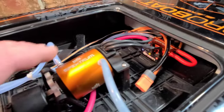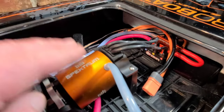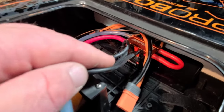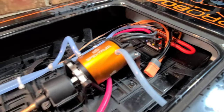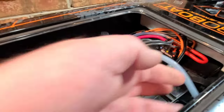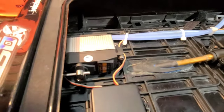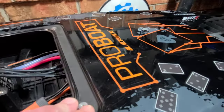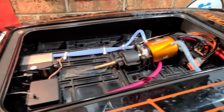This boat's got a 4685 1350KV brushless motor, 8S capable - that thing's got some power. 160 Firma, 8S capable, telemetry capable. Batteries are in the sponsons to help keep the CG down. Fifth-scale servo. It's a freaking blast to drive - I've had a ball. It's tough as nails. I've put this thing through the ringer.